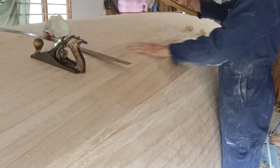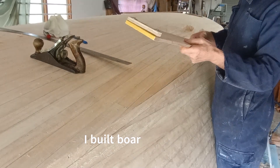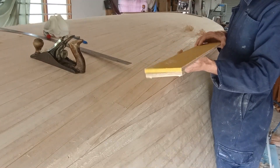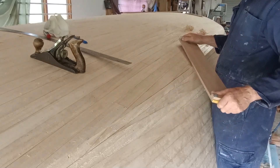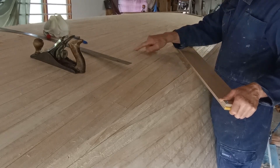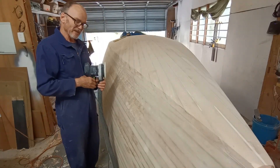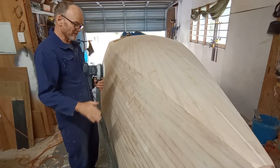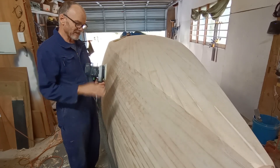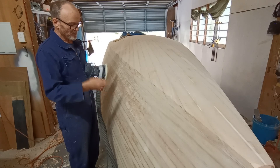It's been time for the torture board. This is some pretty coarse sandpaper — 60 grit. It could be even coarser for this stage of the job, but it sure rips into it and it also shows the high points if some more planing is needed or if you're having a patch of difficult grain. Sometimes it's good to give it a bit of a sand as well, but not too much because it'll float over the surface and won't really flatten things, though it'll take off the furriness of the timber. You can then recheck and go back and forth between these processes.